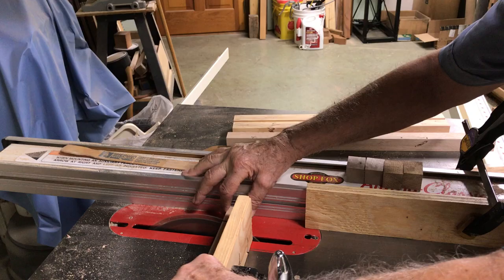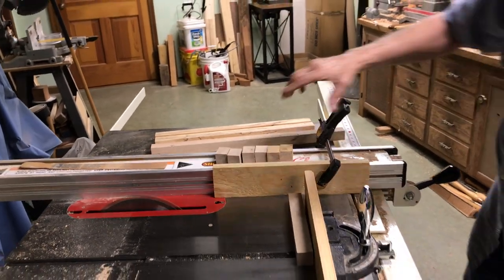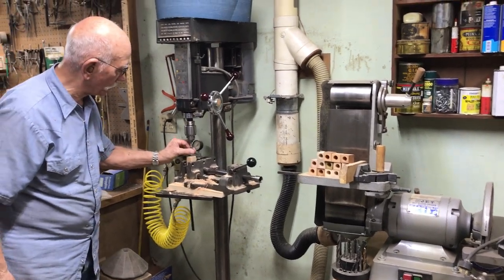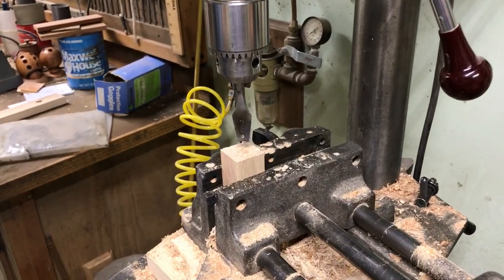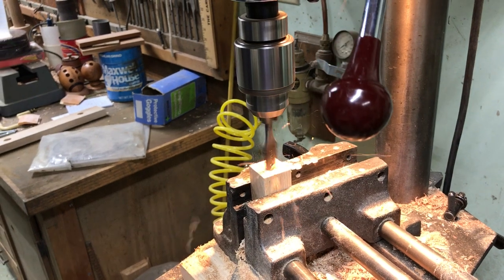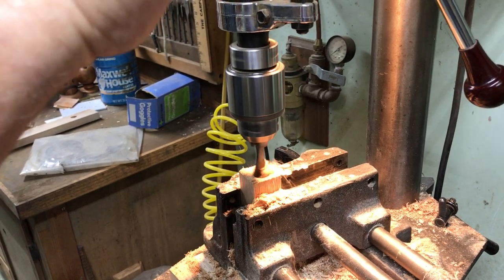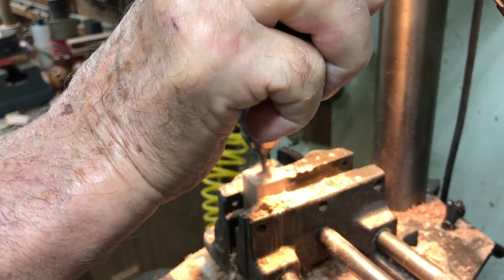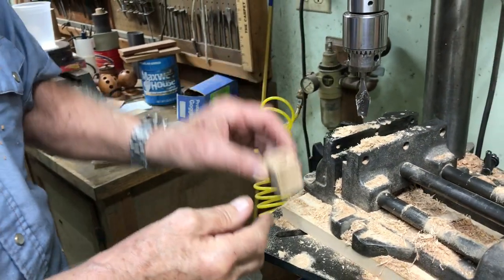You can see I'm pretty close to that tall blade, so I have to be careful. Then I get a bunch of these and just throw them in the box for the next step. Next step is to bore them. You can see I have quite a few bored. I have a special bit that I made — it's tapered. I made it out of a flat bit, and I just bore these to depth. The deeper the hole, the bigger the thimble, because it's tapered. That's one ready to go, step complete.